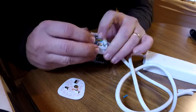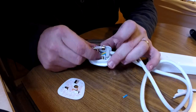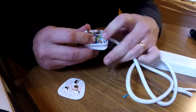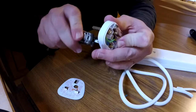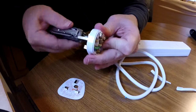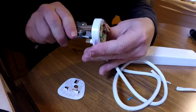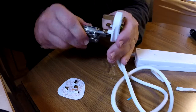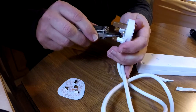So now, pushing the wires into the centre of the plug, just so that it avoids any of the pinch points before we do it up. And also, it's now a good time to do up the two cables on the two screws on the outside to ensure that the cable gets pulled up tightly in there. So just these two screws here. So that will pull this clip down tight there to hold that clip in place. That screwdriver would have been handy.